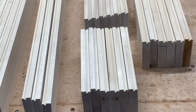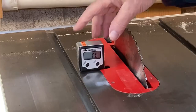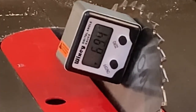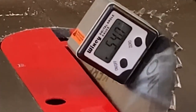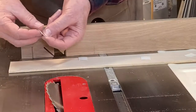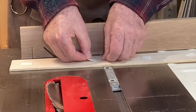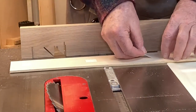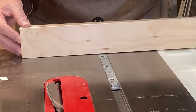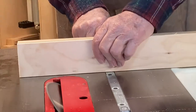All the beads are cut. Now it's time to cut the miters. I find this digital gauge works really well for adjusting my table saw blade to a perfect 45. I always keep a nice, straight piece of oak on my miter gauge, but after a while it gets chewed up. Rather than replace the entire board, I get a piece of quarter-inch plywood and put some double-sided tape on it, stick it on, and now I've got a nice, fresh backer board.